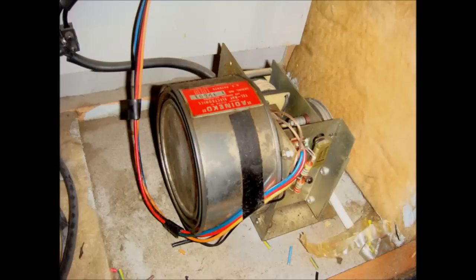This is a picture of a typical Tel-Ray oil can delay, also called an Adineko. This device was sold by Tel-Ray and picked up by a bunch of other companies and used as a delay system, or sometimes a vibrato, depending on how it was configured. It was originally marketed for organs and quickly made its way into guitars and also into recording studios. The idea was that it was a more reliable alternative to a tape echo, that you would constantly have to replace tape. The Tel-Ray system did not use any tape, and the media was a metal disc, so that was not likely to wear out.